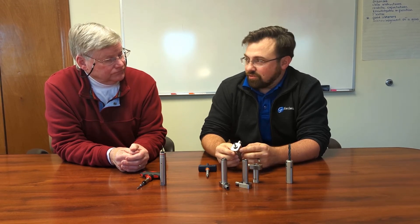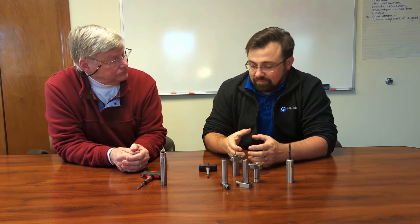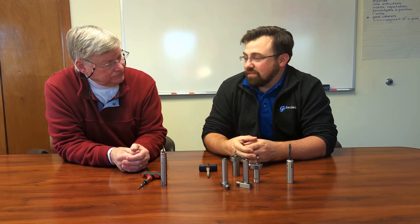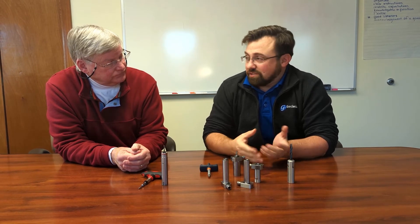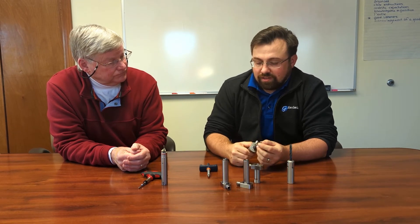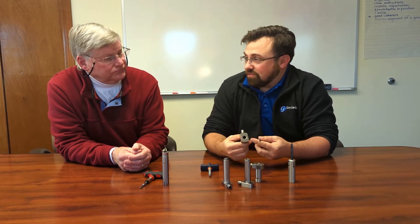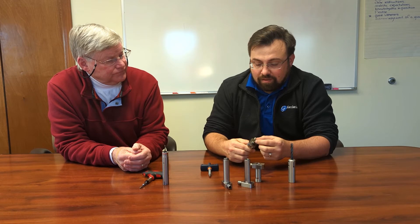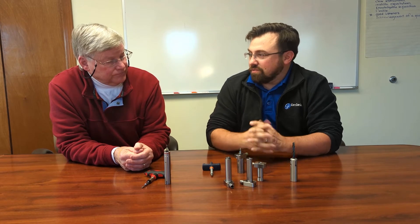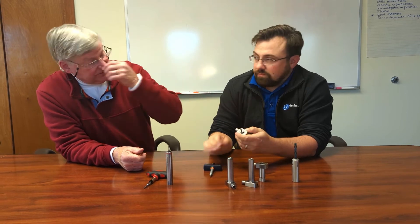It's very accurate in terms of tool holding. When you clamp down on an ER collet — ER stands for extended range — the more you clamp them down, they do lose a little bit of accuracy. The nice thing about ER is they're flexible and easy for tool setup. But on something like this, you're actually directly mounting the shank to a compression sleeve or directly into the tool holder itself, so there's not any room for collapse. It's literally a few tenths collapse to hold the tool.